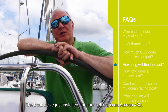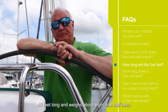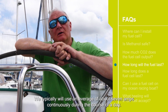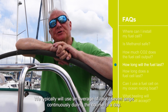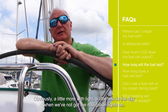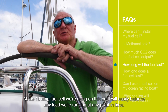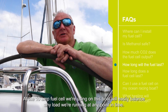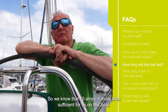The boat we've just installed the fuel cell on is an Arcona 430 — it's 43 feet long and weighs about eight and a half tons. We typically use an average of about seven amps continuously during the course of a day, obviously a little more at night and a little less in the day when we haven't got the navigation lights on. The 10 amp fuel cell we're using on this boat will easily balance any load we're running at any point in time, so we know that 10 amps is more than sufficient.